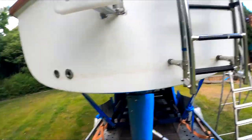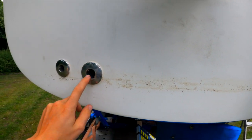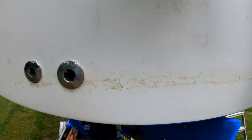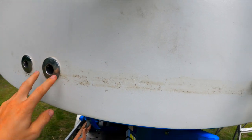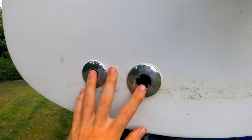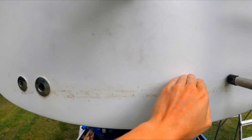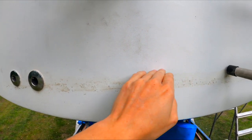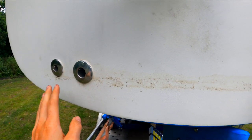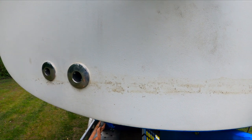The problem lies at the back of the boat. You can see where it's been under water already and the waterline roughly, and you can see the two outlets with different fitting sizes — this is 19mm and this is about 25mm — and where they're located. You wouldn't want to put them any lower, and putting them centrally doesn't really work inside the boat because it's right out of the way.